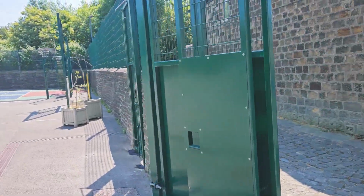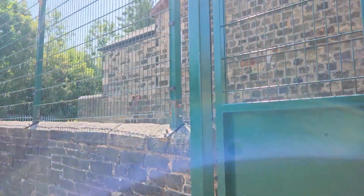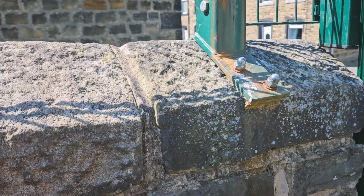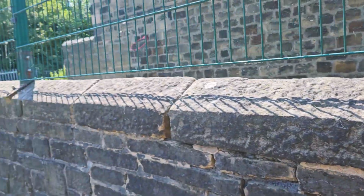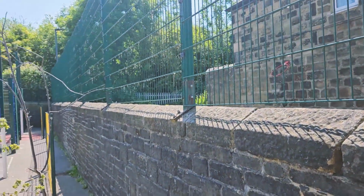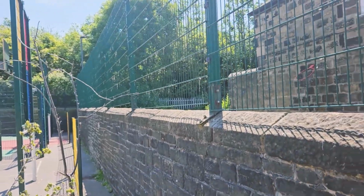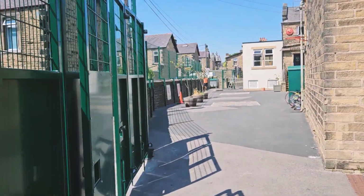It's fencing like this. We actually straightened the post because it was that bad. Fencing like this, done like that, just attached to concrete posts with gobbo. So basically, if one of these goes, it's a domino effect. Every single one of them will topple over. Hopefully it'll fall that way and not this way, because it'll end up killing someone. But it should always be crank posts.